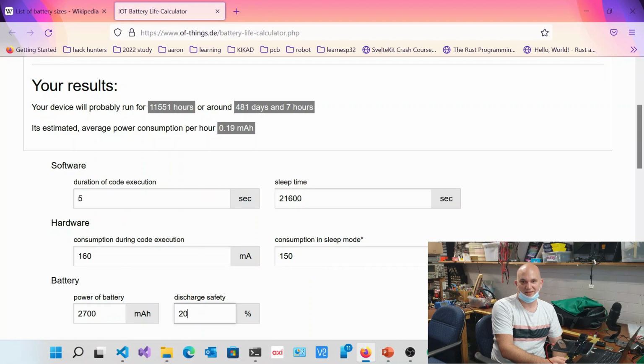So in our letterbox example, where you'd be triggering it via a reed switch, for example, you'd be monitoring a pull-up digital input, a GPIO. You would be running in deep sleep, and you can still pick up those, so you can still use these numbers.